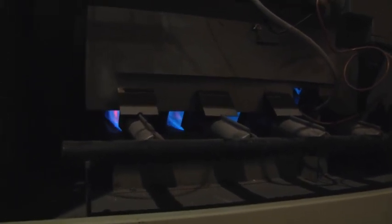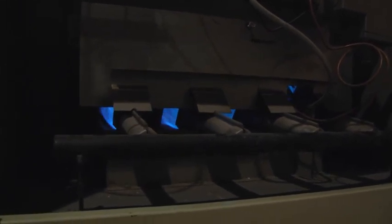The flames are burning. Right when the fan comes on, we want to see if there's any interference in the flame — that's a sign of a cracked heat exchanger. So right when the fan comes on, we're looking for those flames to dance a little bit. Those flames look pretty steady. The fan came on — they're pretty steady. That is one indicator that we don't have a cracked heat exchanger.